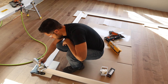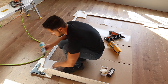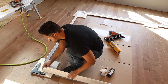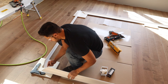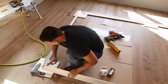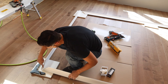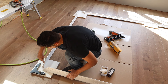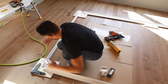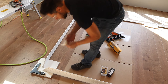I'm going to apply the glue to both sides of the casing. I'm doing this on melamine — these scrap pieces of melamine are a great surface to glue up on because the glue does not stick to it. So I won't have to worry about squeeze-out at the back of the casing, only at the front where I have a damp rag ready to wipe it off. You've got a couple of minutes to work with the Titebond Quick and Thick. Just brush everything out — you don't want so much that it prevents you from closing the miter completely perfectly.